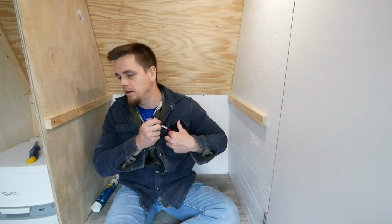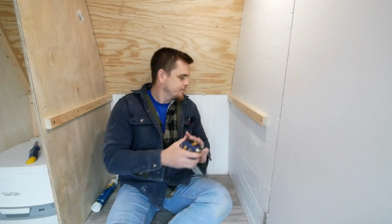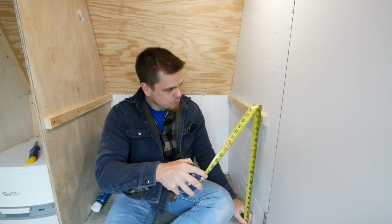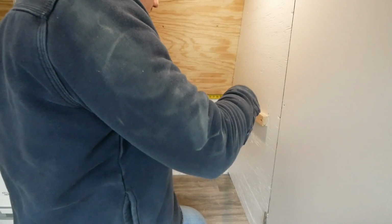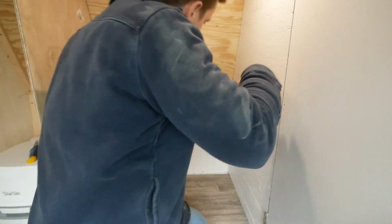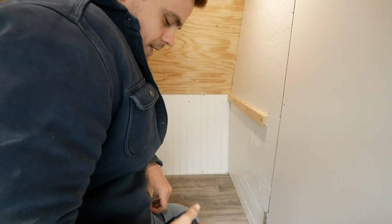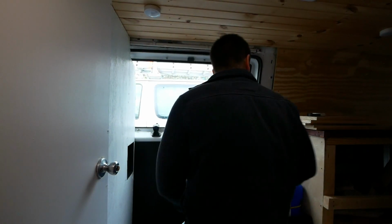All right, let's measure another piece. What's pretty cool is measurements usually don't work out this way. This is 22.5 that way, and then 22.5 that way. Nice and easy. Okay. 31 shy, that's more like 30 7/8. Rather tight than loose. 30 7/8. Let's do it.